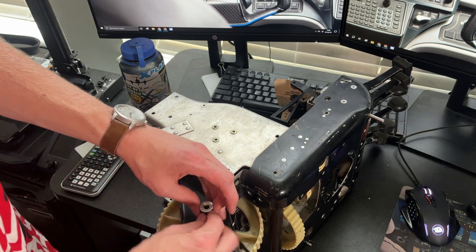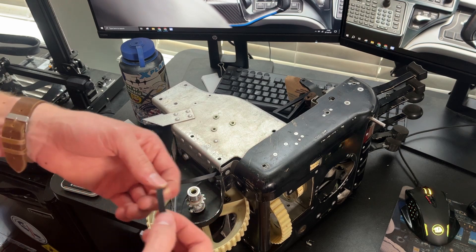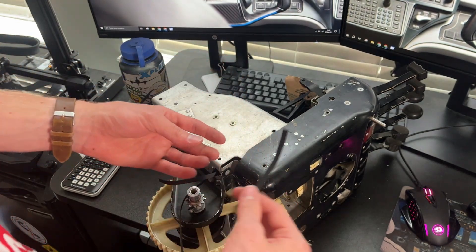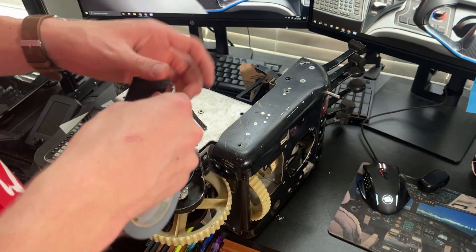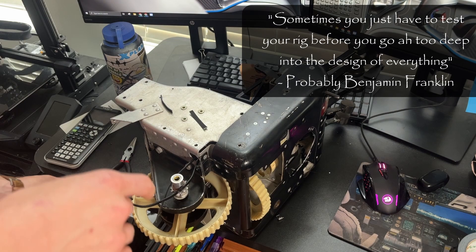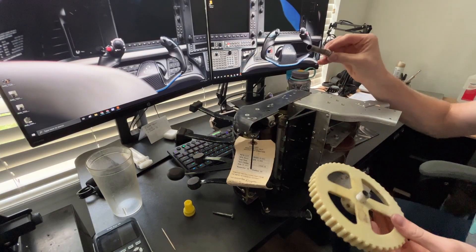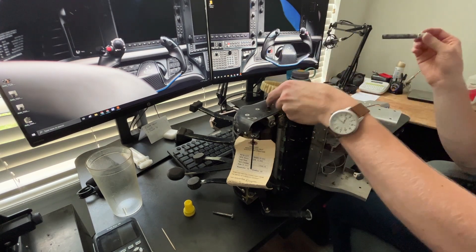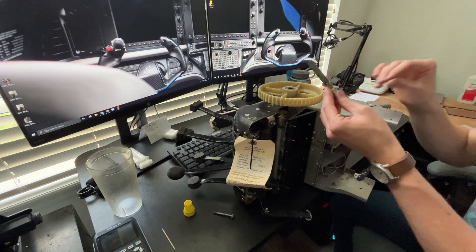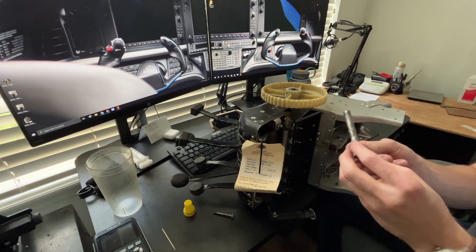The adhesion must be really good — if it's at any angle there may be some pinching. I'm also worried about wear and tear: is this belt going to degrade if it's consistently pulling teeth? That's another factor I'll have to research. I feel terrible for using duct tape on an aircraft part, but sometimes you just have to test your rig before you go too deep into the design. For this, I took out the trim wheel because I needed access to this rod. We need to find a way to mount a pulley to this piece right here, so we need to drill this out. It's best practice to not just go chopping things randomly. We'll grease it up.